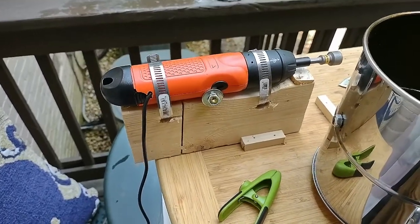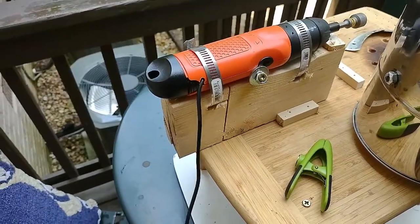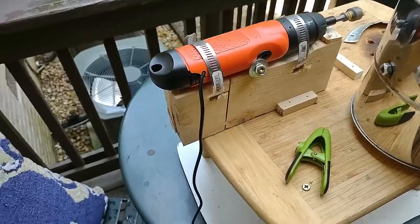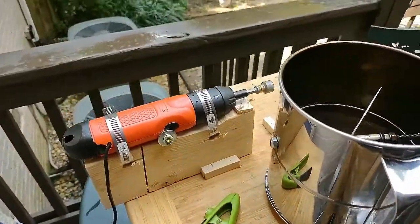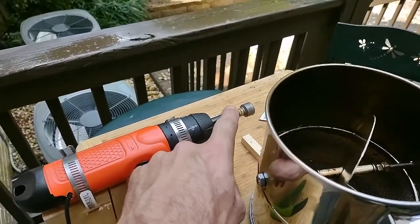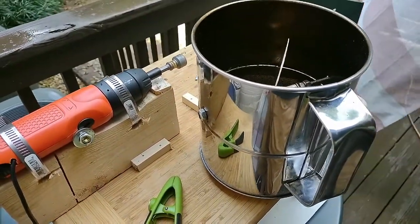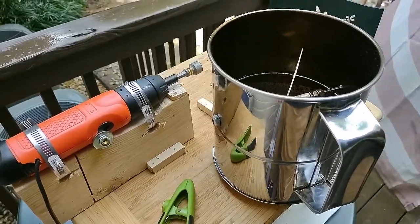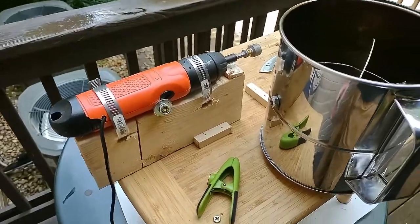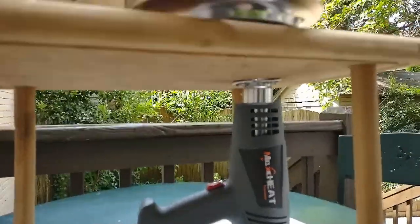One thing that wasn't clear to me from the videos or the instructions was that you actually have to wire this screwdriver — it's a battery-operated screwdriver, so you have to wire the battery terminals into an actual plug. Another thing others did was put a relay in there so that when you touch the end of that to the sifter it would start automatically. I just made it so it turns on when I turn the power on, which also turns on the heat gun mounted down here.